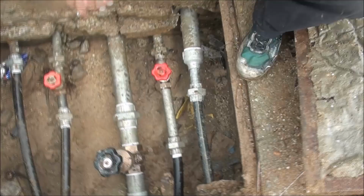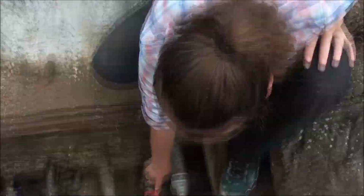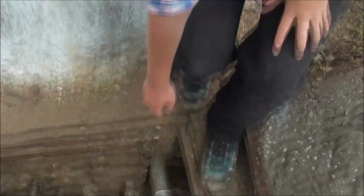This valve here allows you to easily drain the tank down the 63mm HDPE pipe to an energy dissipation system. This will make it easier to clean out the tank and make repairs. This next pipe, second from the right, is going to be your community pipe. This valve says how much water is flowing to the community reservoir tank that is in that direction somewhat. And this pipe that flows into our drainage pipe is the overflow. This big pipe here is the one that connects to the drainage and overflow, and the rest are up there.